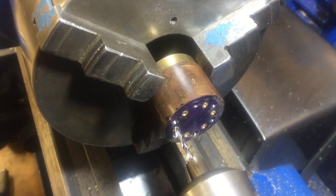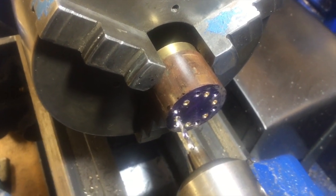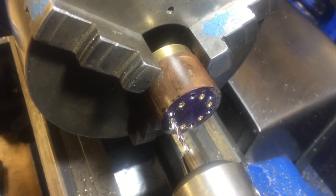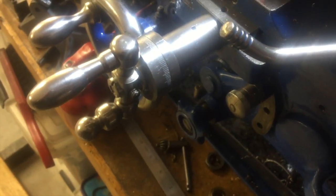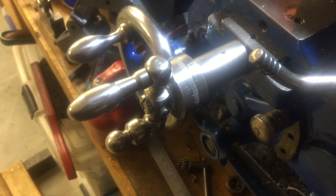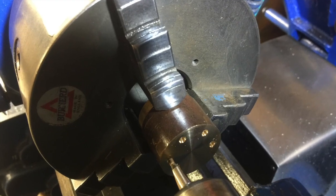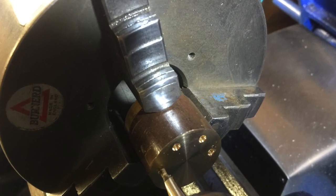I went around and drilled six holes in those positions between the original six, so now I've got 12 holes. Now I'm going to do the same with the other holes. To work out where to put those, I noted the position of the cross slide on the corner hole and also the position on the middle of the flat hole, then went halfway between the two and set the drill at that point. That should give me another 12 holes between the others.